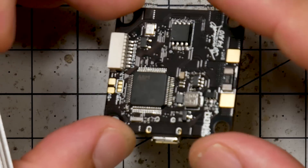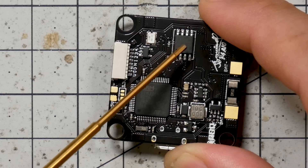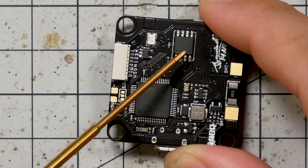I'm actually working on a video showing how to do that. The thing you'll notice missing here is the SD card reader. Without doing a total redesign of the board, we had to pick between the plug header and the SD card reader. So many people are using 4-in-1 ESCs these days, and as much as I love Blackbox and use it all the time, fewer people use Blackbox than use 4-in-1 ESCs. So I bit the bullet. We do have a data flash chip on here — 16 megabytes of storage — so you can still do Blackbox, but you can't just pop in an SD card and log for weeks and weeks like you used to.